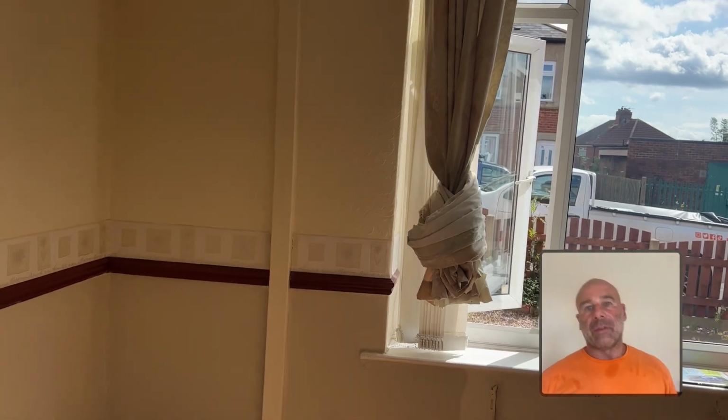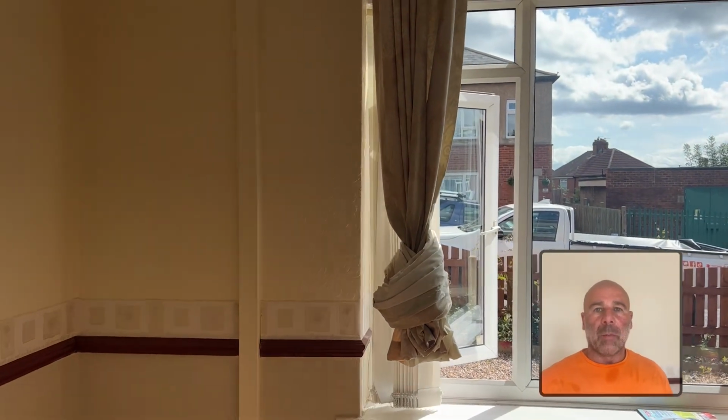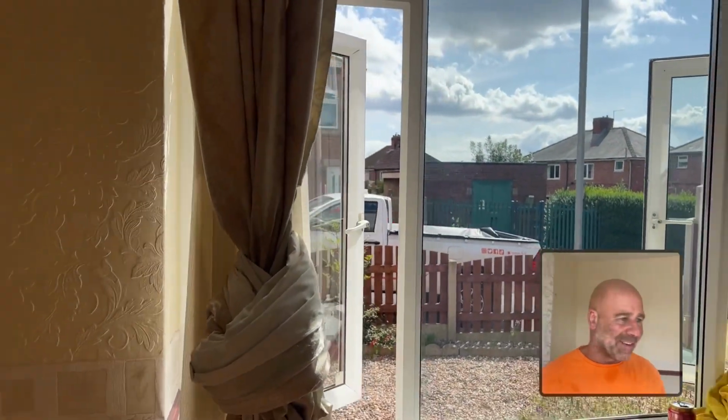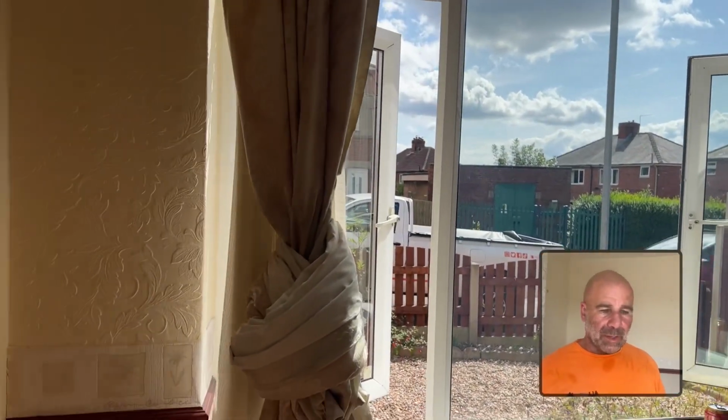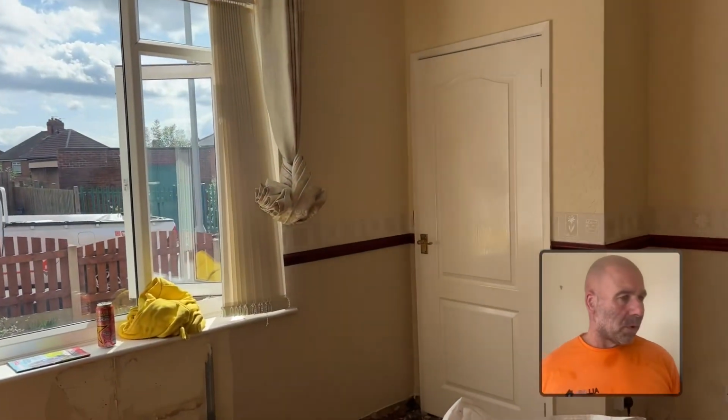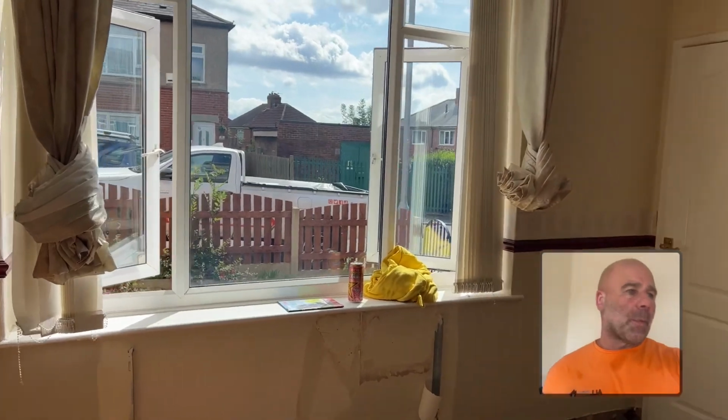And then what they've done is they've plastered all the way to the floor. But not only have they plastered all the way to the floor with just normal sand and cement or sand and cement lime, somebody's gone round then and put browning on, or bonding, a Carlite backing, which is even worse. So we stop it bridging all the way around.